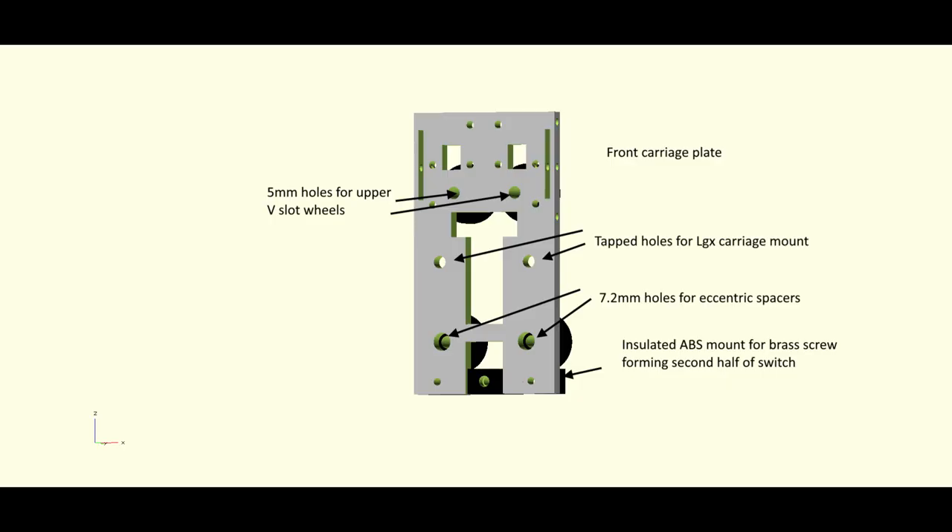The next thing I need is a carriage to bolt it to. This is all a work in progress — it's a bit big and chunky and I've got more work to do removing excess material to save weight. This comes back to a comment I made in the first video: if I was starting from scratch I wouldn't be using these OpenBuilds V-slot carriages because they're so big. But I've got dozens of those wheels from a previous CoreXY build, so I'm using them. If I had linear rails they would be a lot smaller.